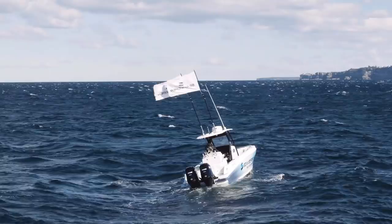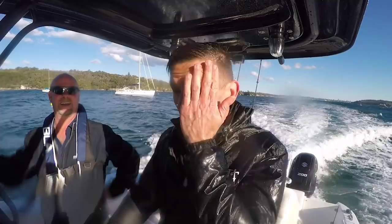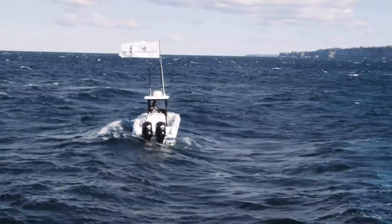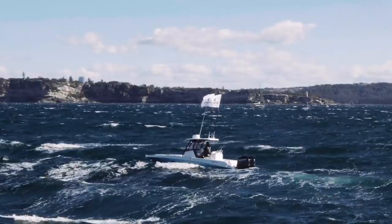I floated down in a beam sea with the gyro off — like a traditional trailer boat, it's nice and tender. You'll see in the footage the boat was just rocking and rolling away, and I wasn't really enjoying myself — it was pretty average out there. Then I came back, turned around, did the exact same test with the gyro on. You'll see in the footage the boat just stays 100% flat. It'll still go up and down with the seas, but instead of rocking and rolling, it just goes up and comes back down.